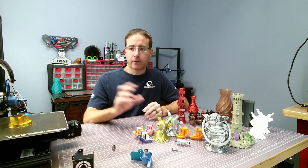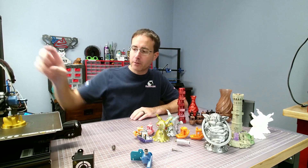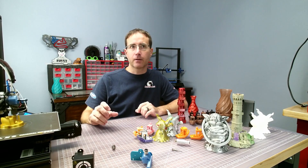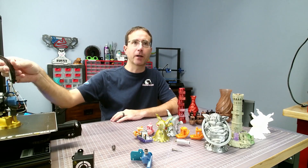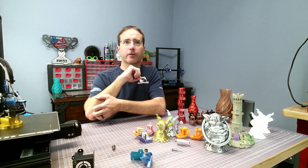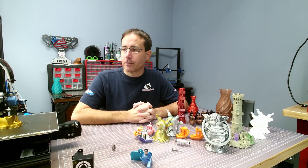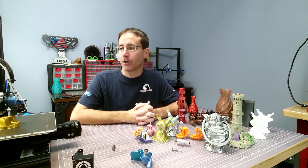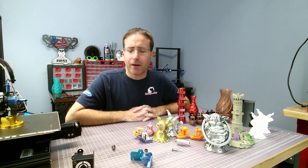The biggest thing I'm struggling with is the stock plastic extruder on this machine. With slightly longer retraction settings, I noticed it was flattening the filament enough that when going through the stock PTFE tube it would create more resistance and eventually cause a grind-through — not a fault of the hot end, just the plastic extruder. I'm going to swap that out for a BMG with Capricorn tubing. I think the hugely overpowered spring and the way the plastic flexes is the issue.